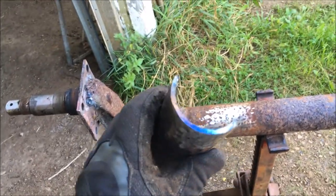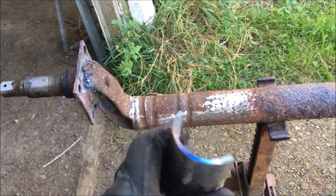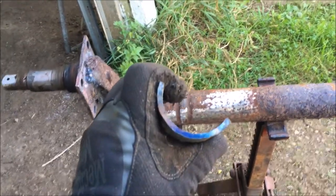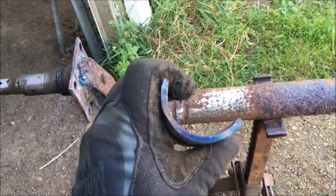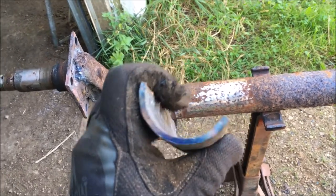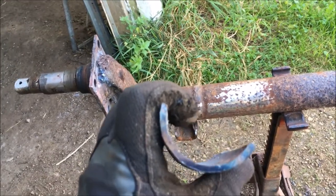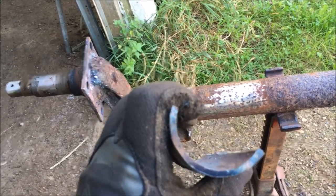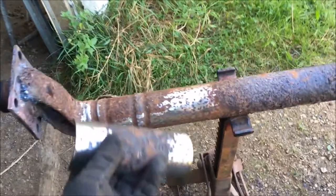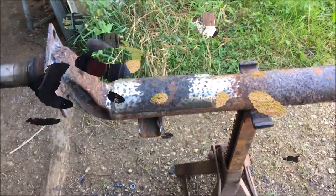I think this is going to work. I've got my piece of the old axle all cut out and cleaned up — as you can see it's fairly thick. It used to be quarter-inch; looks like it's probably three-sixteenths now after cleaning. I've got it cleaned up and I'm going to clamp it in place and get it welded on.